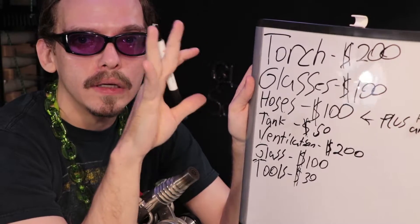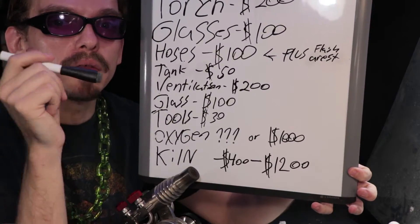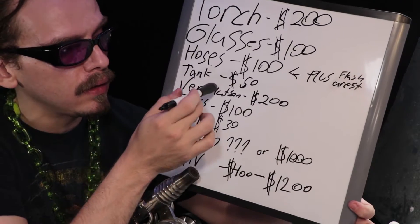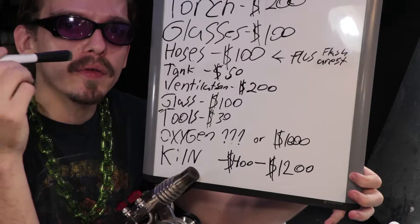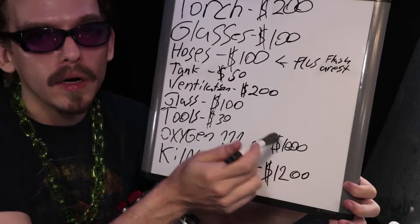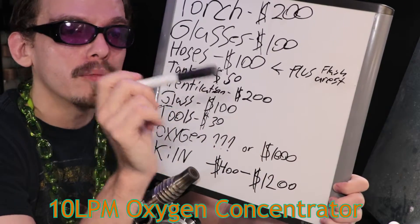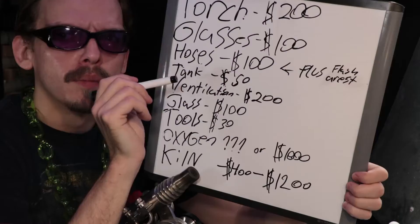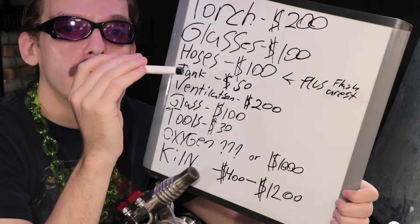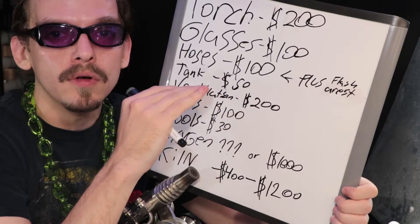Your hands are really the best tools you're gonna work with the most. For the oxygen, you're gonna have to call a local supplier and ask how much it's gonna cost to rent a tank and how much to refill it. It's definitely gonna be more expensive than the propane and you go through oxygen at a much quicker rate. Another option for a longer-term investment would be an oxygen concentrator, which can start easily at $1,000. But in the long run it could be a better investment — a 10-liter-per-minute unit will run your smaller bead torch for years to come, rated for about 20,000 to 25,000 hours. It does run on 5 amps of electricity, so it might depend on where you live whether it's cost-effective.